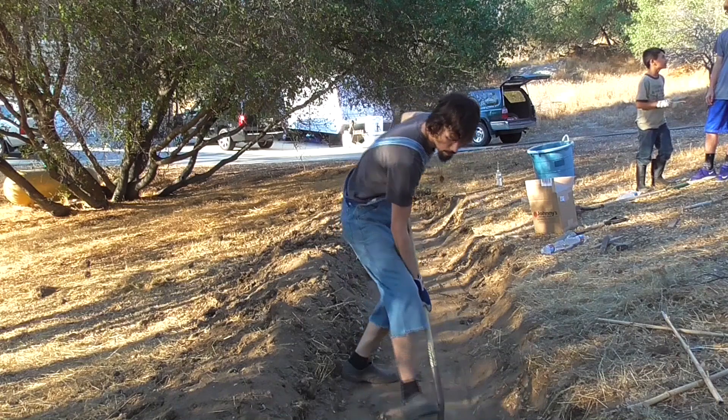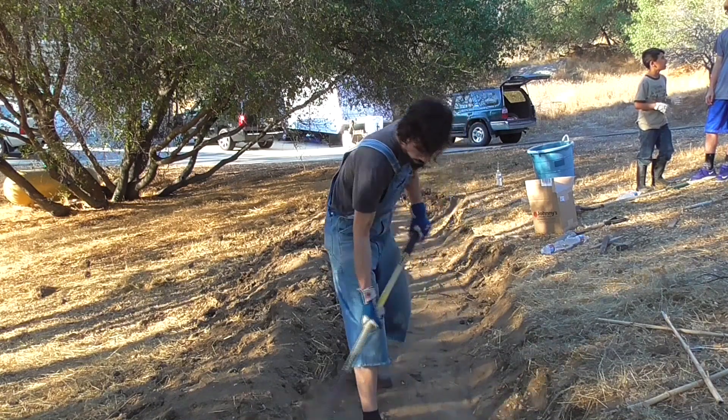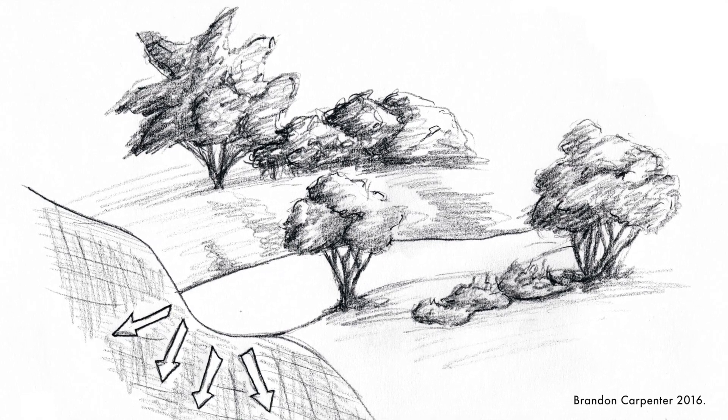Your ditch actually might not be that deep off of the original ground, but it's twice as deep as it is high on the berm side, because you keep going down and keep coming up in the same proportion. You've created this yin-yang kind of thing, going up and out, so water can come down and has all these surfaces to press into.